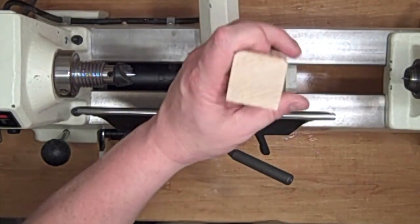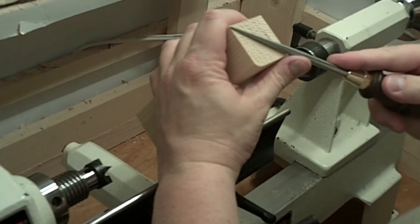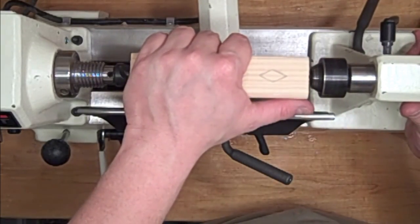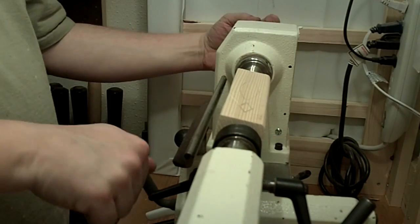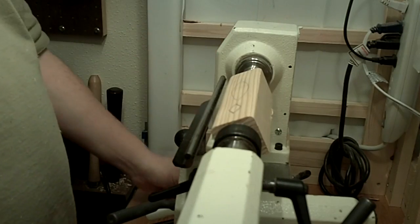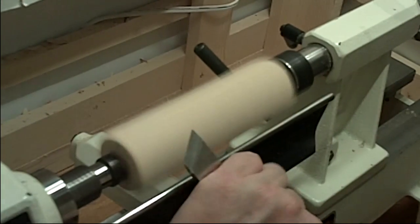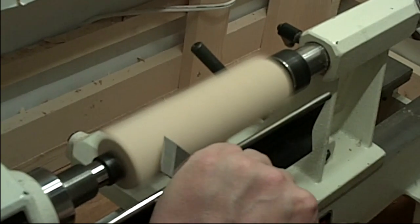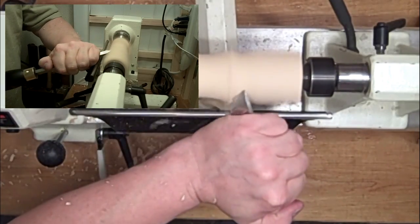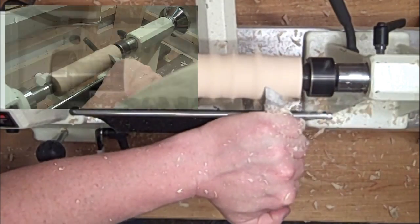Before any practice, you got to warm up. So starting off, we got to do some quick calisthenics. I've got some construction grade lumber right here — just cheap pine. I cut it in squares and I'm setting the center by just lining up the two corners. Go ahead and mount it on your lathe. Be sure once you've got the tailstock up tight, you check that your tool rest is the proper distance by turning it by hand. Do not turn it on until it is set and locked. Then check the sharpness of your tools — I typically do that by just scraping and planing on the corners all the way across the blade. Now we're ready to go. We're about to do all the cuts that we normally do in this project.